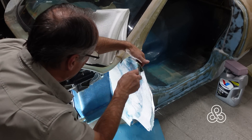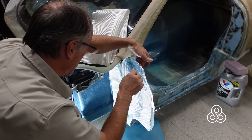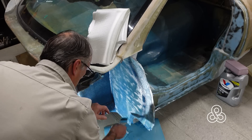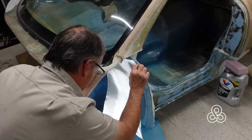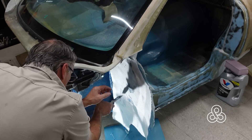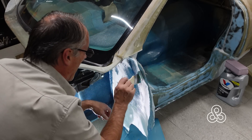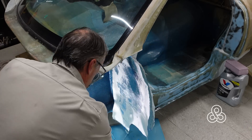This little panel bulkhead didn't have to have a lot of strength originally — the worst thing it would ever have taken would be maybe a blowout flying up against the front of the door. But we need to add some more strength to it, and that is going to be done by adding a perpendicular piece into the front. The perpendicular piece will also be basically the bottom side of the mounting point for our door hinge. Once we get this lamination done on here, we'll flip around to the side and I'll start to go into the explanation of that piece and how it's going to be created.